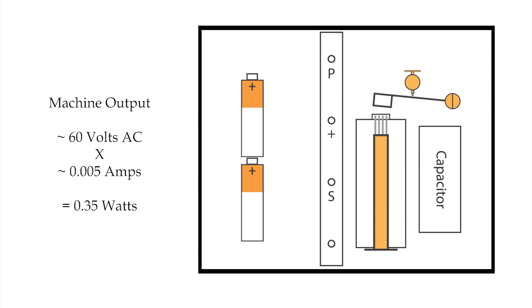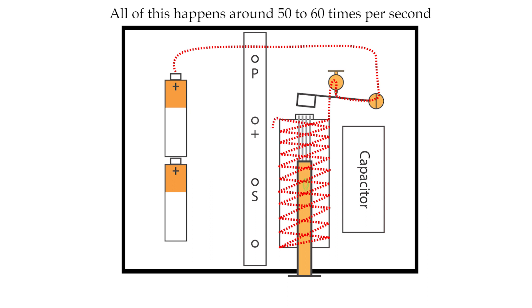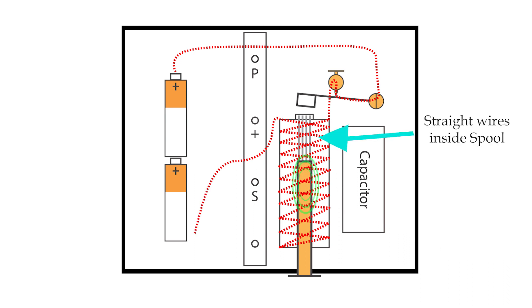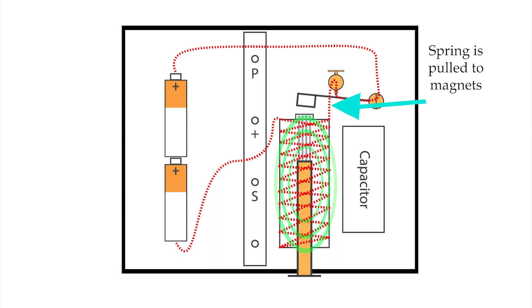This system requires high enough voltage so that the electricity can flow through the patient's skin. What this setup does is the three volts goes through the circuit and through all these parts until it hits the primary coil. This coil is wire that is wrapped around a core of iron wires, and the flowing current starts to generate a magnetic field within the wires. This magnetic field, when at maximum strength, is storing a lot of energy. Now, there is a secondary coil of very thin wire also wrapped around all of this, many, many, many more times.